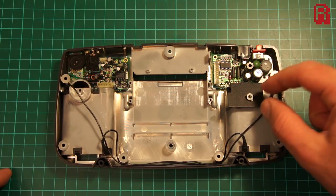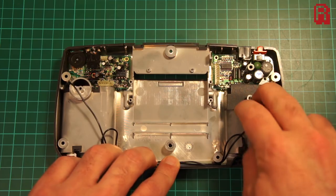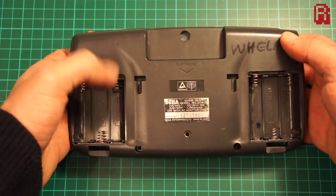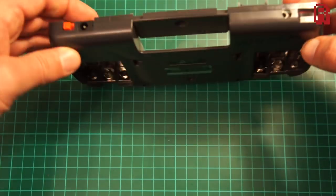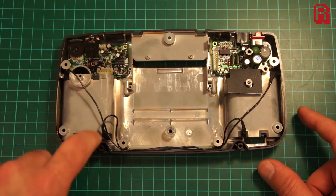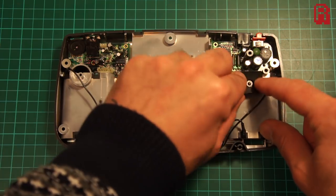If I pop up the screen and lift up the shield you can see where the battery power comes through into the power board. The batteries this houses are 6 AA size batteries — 1.5 volts each, giving a total of 9 volts. Given that the Pi only uses a 5 volt mini USB power connector, in theory that should give us a longer battery life with the Pi than the original Game Gear ever got. The black cable simply connects the left to the right battery compartment, feeding all of that battery juice into the power board.